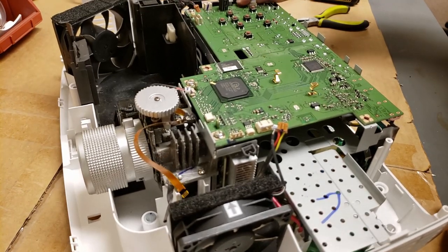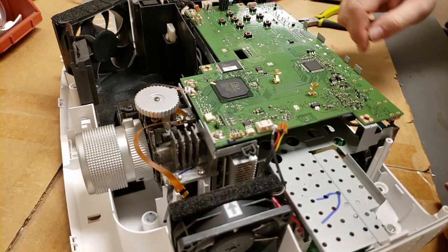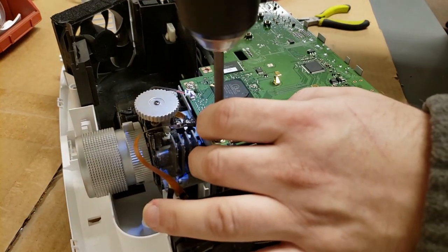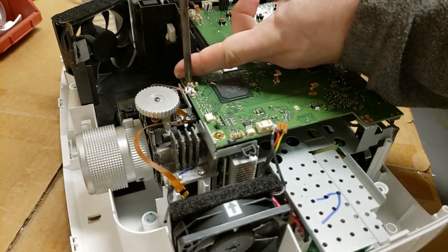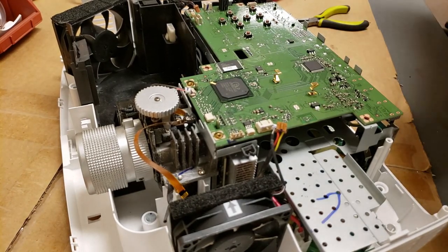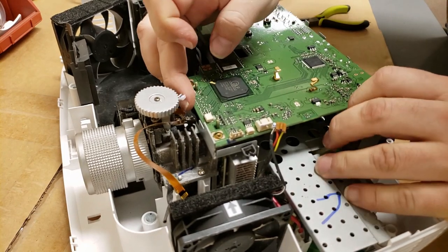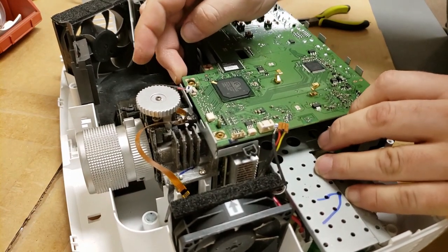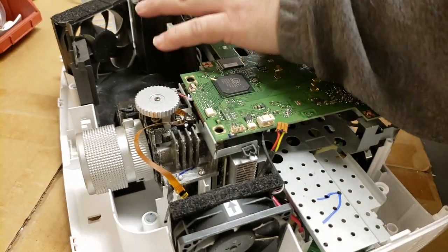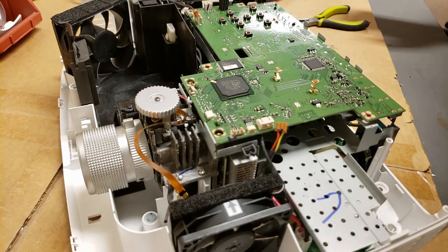This is ballast right there, so the power must be just, power's right here, coming up. And then these two screws that connect it to the DMD. I really hope that fixes it, the cleaning, because I'd really hate to tell somebody a two-year-old projector has a bad DLP chip. You can see I just twist and lift, and then take out the third screw that I neglected.